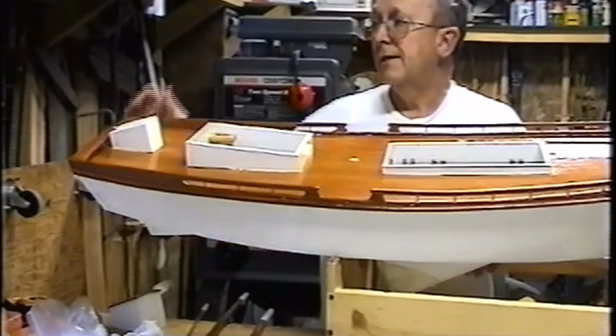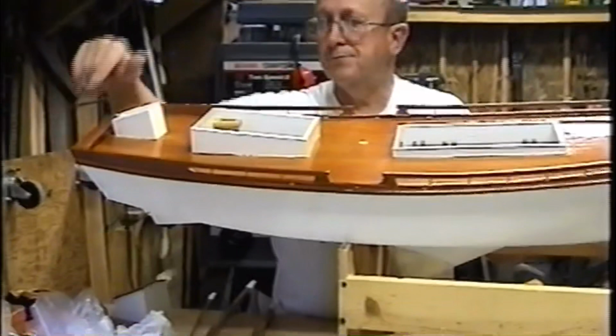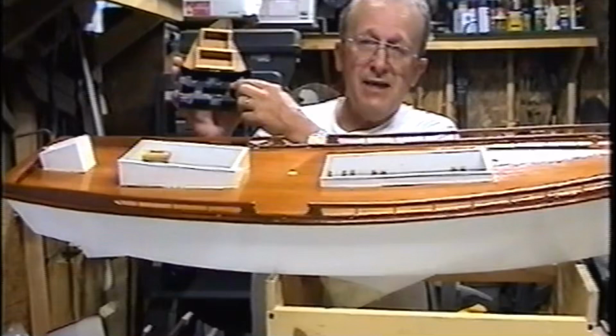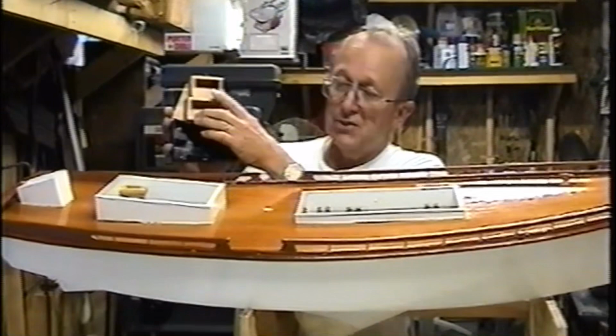Remember that you've got a rudder that will hang back here, in this position. And the rudder servo sits in here and is able to turn the rudder left and right. The slot that goes down in this hole is basically made up of power for the batteries. These are D-sized batteries, and these are totally for the sail drive mechanism. But also in this slot is an AA battery bank. That's for the receiver unit in the boat, and right here is where the receiver unit will go.